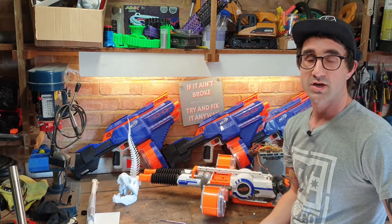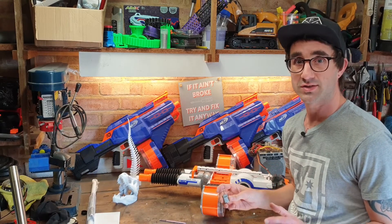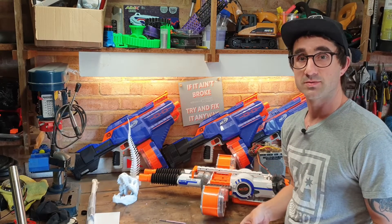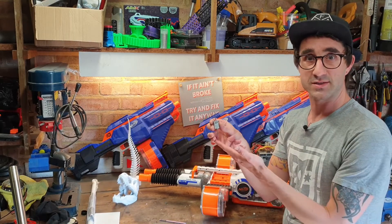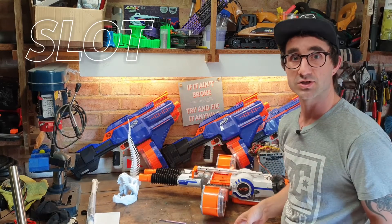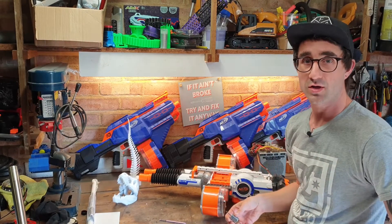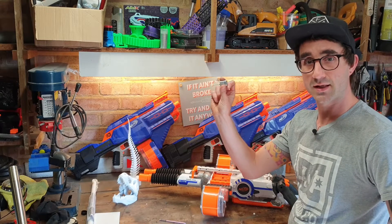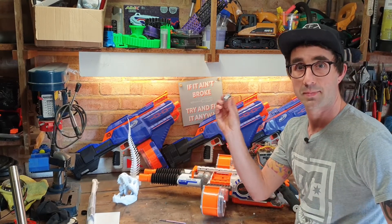The process I used was pretty ropey, I must say — it wasn't the most gentle. I essentially followed some YouTube videos on replacing shafts in these little motors, which is pretty similar to replacing the shaft in a stock slot car motor. It's a 2mm shaft. I saw lots of videos of people replacing shafts in little 130-size motors using things that were 2mm, like bike spokes.